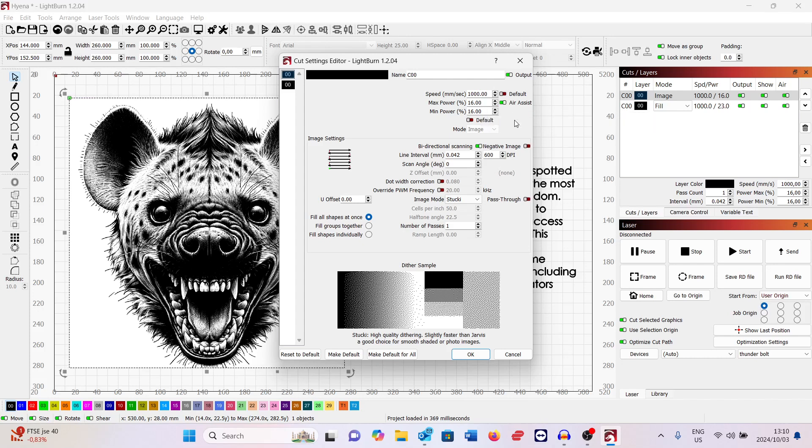The power felt a little under, but that was fine because I knew I was going to engrave the image twice, so I was trying my best to avoid dust. You also didn't want to warp the material — at higher power settings the material looked darker but it started to bend and bow. It was even raising off the honeycomb and the magnets were keeping it down, forming a kind of dome. So it was pretty tricky — I felt lower power with a double pass was the best approach.